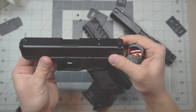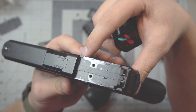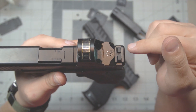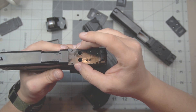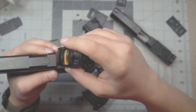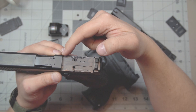The same thing has to happen between the plate and the slide, because now you've created a unified body that is still reciprocating back and forth, and that force still needs to be transferred down into the slide. We've got fasteners going from the plate into the slide, but those fasteners aren't meant to take that kind of force. This is a Glock 45 MOS — pulling the plate off, you can see in the slide a valley down the center of slightly raised material as well as a raised nub. That raised nub, along with the fit of the plate inside, keeps us from getting a lot of movement — about five thousandths of an inch.